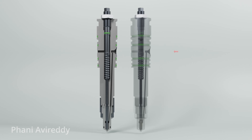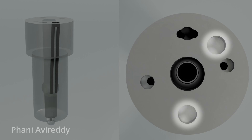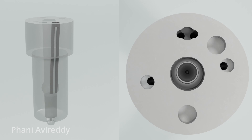During the injection phase, pressurized fuel flows into the fuel valve body and then moves towards the atomizer. Within the atomizer, the bore is split into two parts as shown. The two holes on the atomizer serve as locating holes for the double pins, which ensure correct assembly.